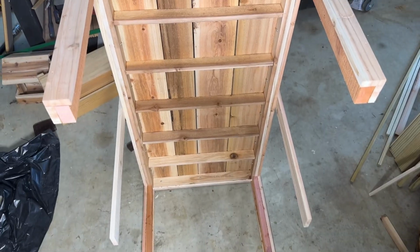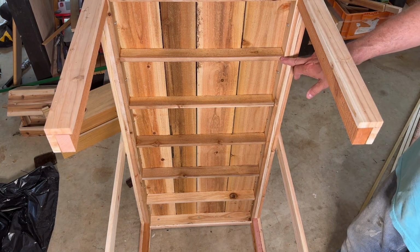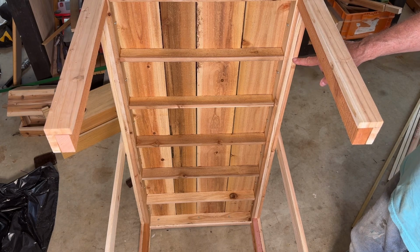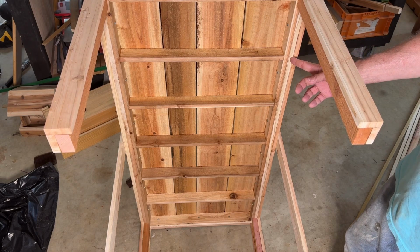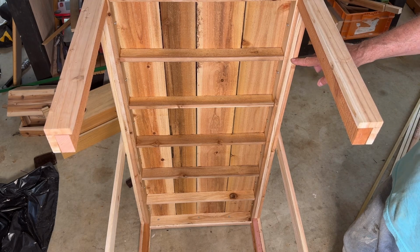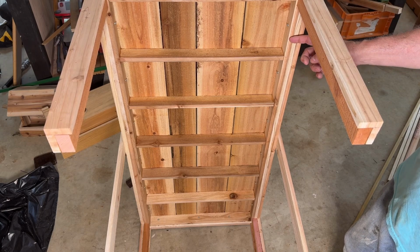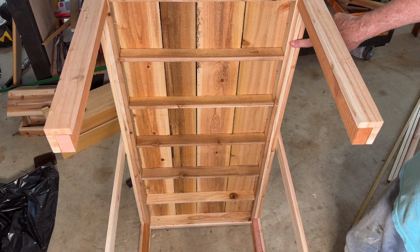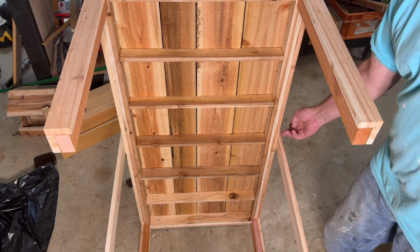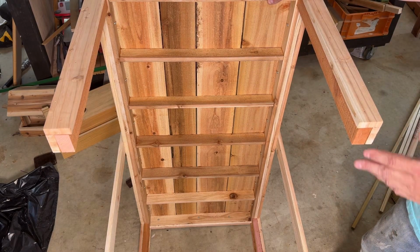So have a look at the underside. Fence pickets are not obviously 2x4s. All these joints are glued. These nails go through 2 of these to here. And then because I put 6D nails in here, they were 2 inches long, but I knew I was going to put this piece of trim on here. And then so I shot 1 1/4 inch brads through all 3 of these. And then I used 2 inches to go through these. I think this is going to be plenty sturdy.